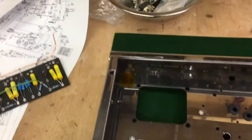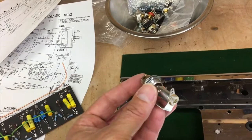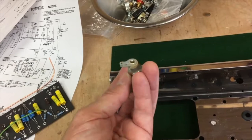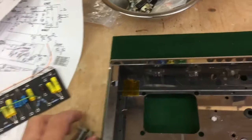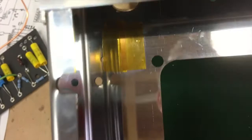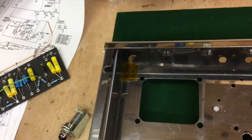The first thing is something I noticed while doing a test fit of the pilot light. This little guy fits in this slot right here and it's powered from these two points from the heater supply, which is low voltage but high current. The problem is when you install it, this little edge right here gets quite close to the chassis. If it gets a hit sometime in the future it could actually short itself against the chassis. So what I did is I put some Teflon tape on the chassis to insulate it — that should alleviate any potential future problems.